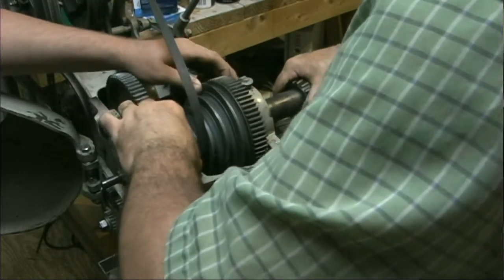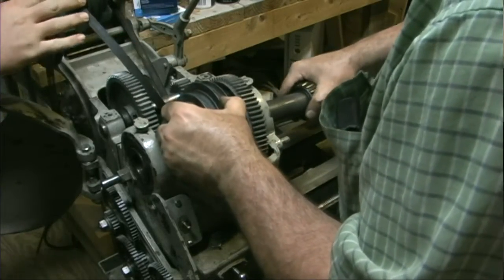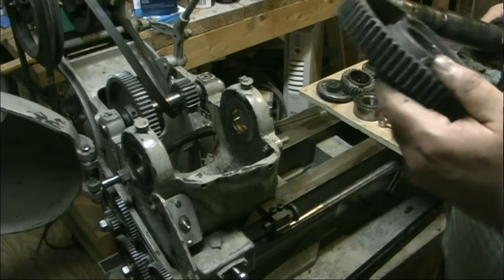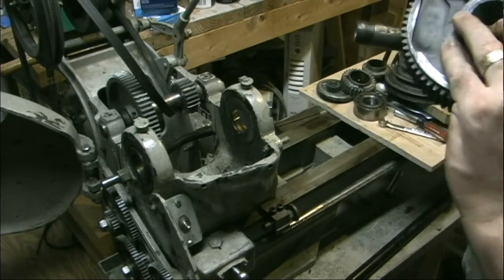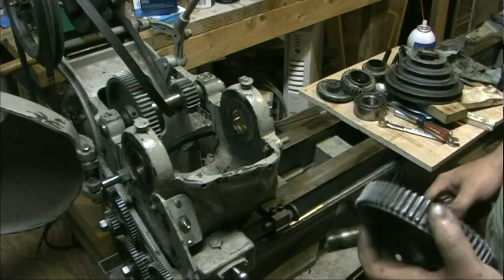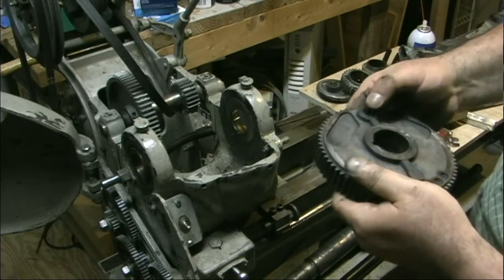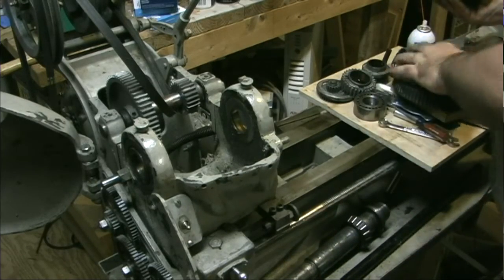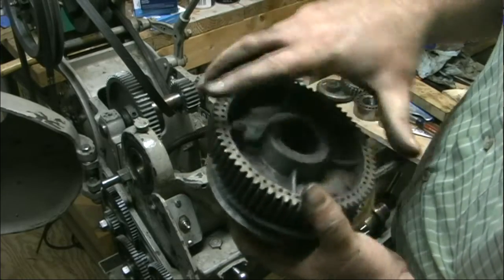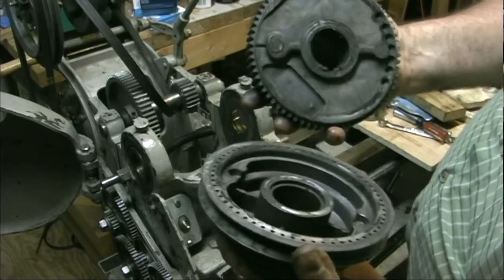The spindle is actually coming out now. There's part of the bull gear, and the pulley, and finally the bull gear itself. I'm not sure — I think that might be sheared off, but no, the pin goes in and is free moving. I'm not sure what the problem there was. The pin is supposed to slide into one of these notches here, and it does — so I don't know why I couldn't pull it out before. Maybe it just needs to be cleaned and lubricated.